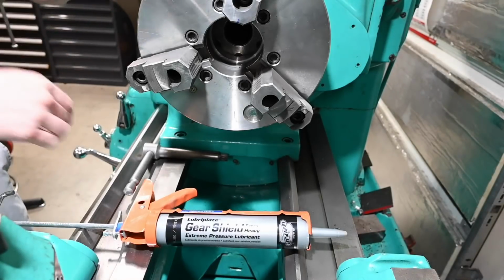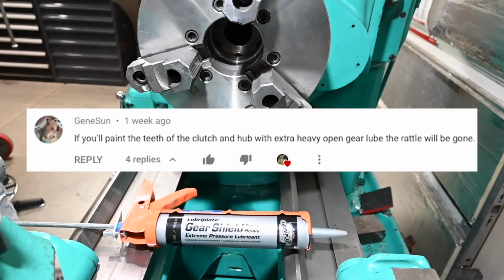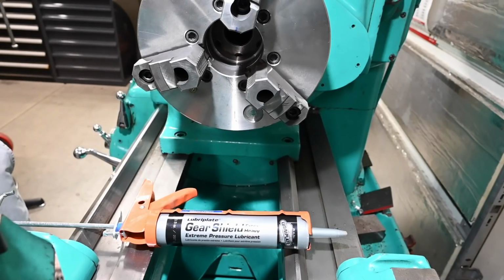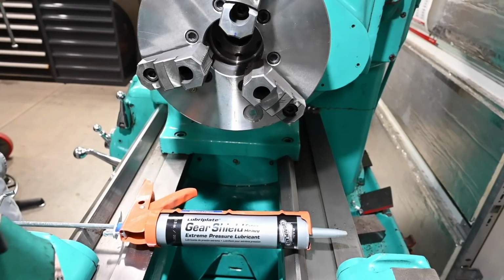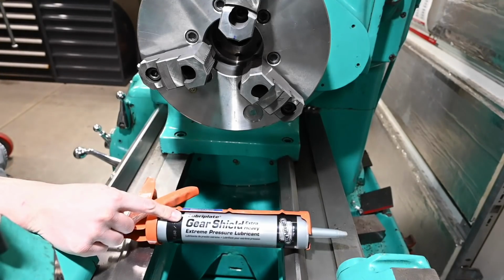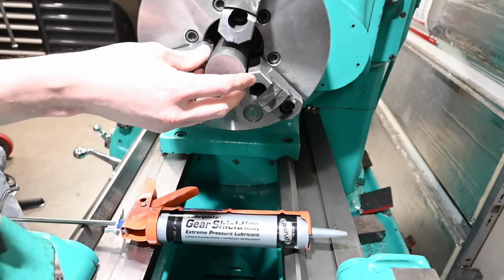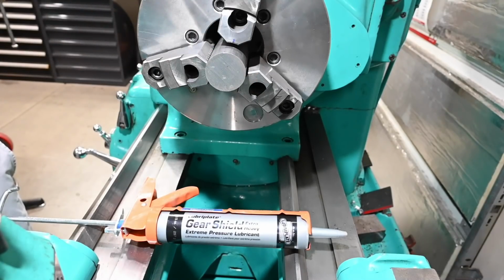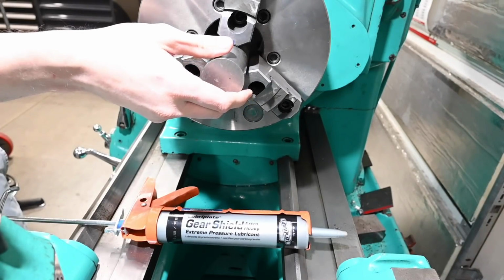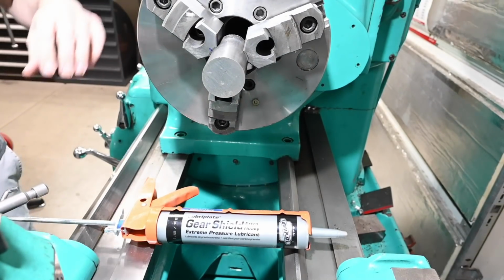As we get set up here in the lathe, I wanted to say thank you to one of the subscribers who had put me on the right track to the right answer in getting rid of the rattle sound. So he wasn't exactly right, but it put me in the right spot. So what I used is some of this Gear Shield's extra heavy extreme pressure lubricant. So this is a heavy industrial oil or a heavy industrial grease that's used a lot in oil extraction and mining and stuff like that, used for open gearboxes. So that's essentially what my clutch is, in some ways anyway.